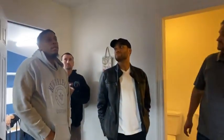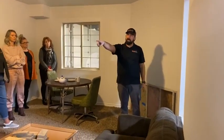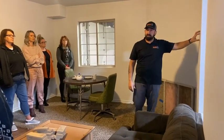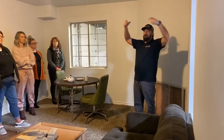So if you wipe the walls and then like the insulation, usually the insulation is not salvageable, right? Insulation is usually only on exterior walls. Usually the interior walls of the house, like this wall behind us here, is not insulated unless you paid extra when the house was being built to have it insulated. But most of the time it's just exterior walls that have insulation in them. A lot of times these walls, the way they're built is you have a base plate, a 2x4 that runs along the bottom and along the top.